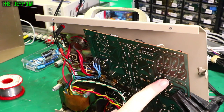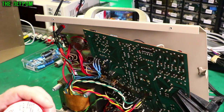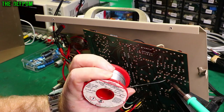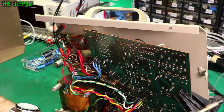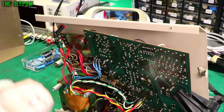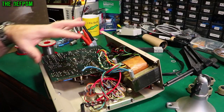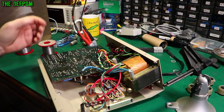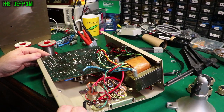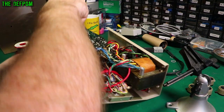I might have a little inspection around. This pin here on the switch isn't looking too well soldered — I'll just touch that up. I should go through and do a full inspection of the circuit board to make sure everything is actually looking all right. I've resoldered some joints on these switches — mostly okay, but about half a dozen I just touched up because they weren't quite as good as I'd like them to be.